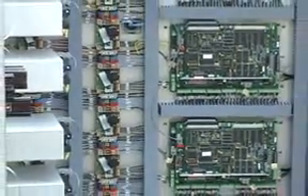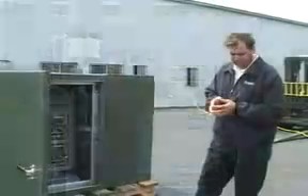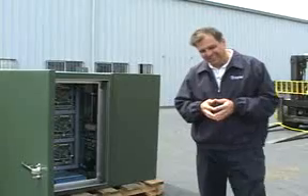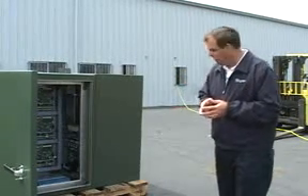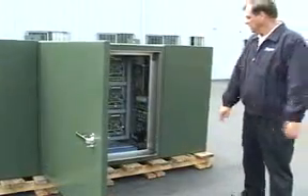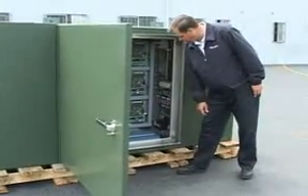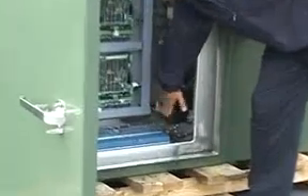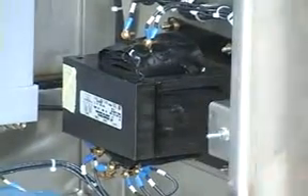You can use either radio, fiber, or cell net to communicate with this unit and do all your remote operation. There's a PT connected to the main line bus on every phase in this unit, and we have a transfer network. The dual voltage power transformer — which allows you to switch for different line voltages — is mounted on the side of the unit. The toggle switch here selects your main voltage, whether it be 12,470 or 24.9 kV.